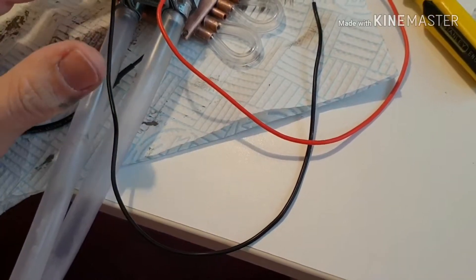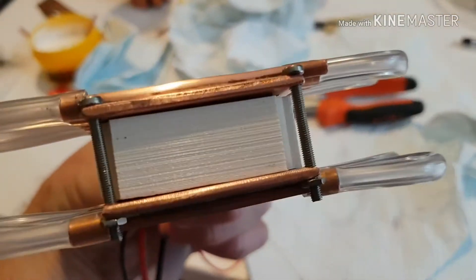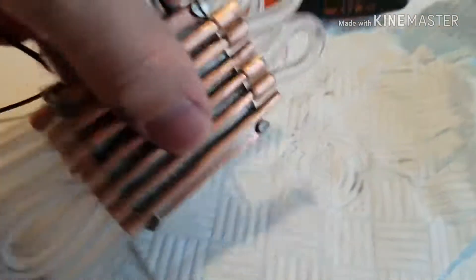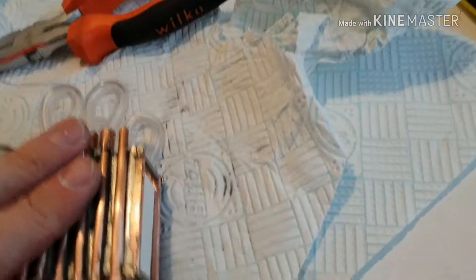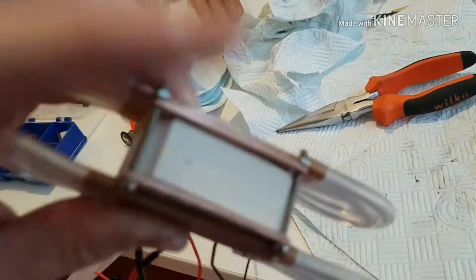So this has the polarity the same — hot side onto the heat exchange and the cold side upwards. And here it is: the completed stack-up. You can see we have a spacer in the middle, which is 3D printed, holding everything together, with the stack-up inside there of the two Peltier devices, the heat exchange block, the nuts and bolts, and the two heat exchangers on the outside. There's quite a bit of thermal paste in there — part of the reason I wanted this spacer was to contain that thermal paste and try to prevent it from producing a heat pathway straight across the Peltier device.